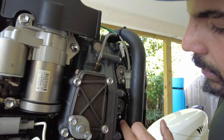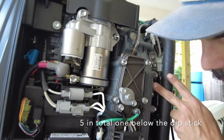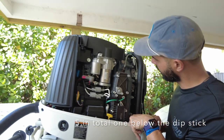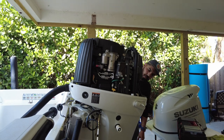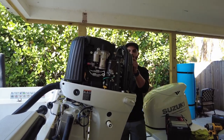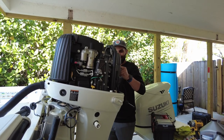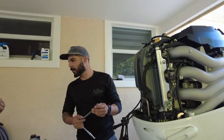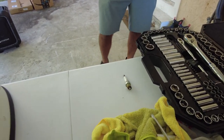Check the anodes here and see if they're in good shape. There's four of them. Look at that — beautiful brand new motor. One there, and the other one is down here, which is in a pretty bad spot. We're looking for black on the anode, which would mean it'd be burning bad. These look pretty good, let's hope they're all the same way.